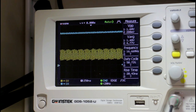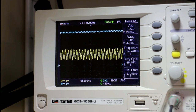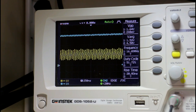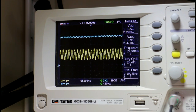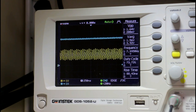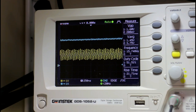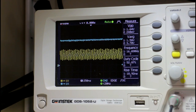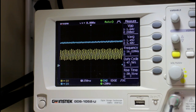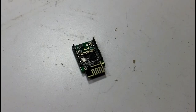We can do a similar test looking at the clock signal this time. Starting around 4.8 volts with the blue signal going down, the yellow signal is our clock signal and you can see it's generally around 16 MHz — it's jumping around a bit because I don't have the right probes for this; ideally you'd use a differential probe. As the voltage drops and we're down to 3.7 volts, our clock is still roughly at 16 MHz. It's safe to say both those changes are working successfully in the range of a one-cell LiPo battery.